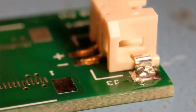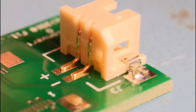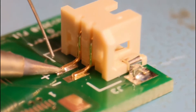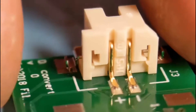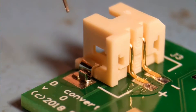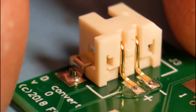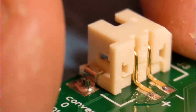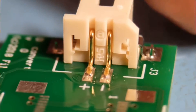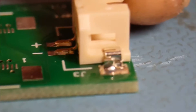Turning it around — you've got two pins. You've got to be really quick here. All you're looking for is a fillet that fills up the sides and runs around the back. I feel it out a little at the front so it goes around the sides all the way to the back. Then turning it around to the other end, I'll do the main lug there. These two main pins — you don't want to be on them too long because if they move, the thing plugging into it will have difficulty. I clean all this up after — you've got a nice fillet down there with solder running up the sides.